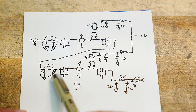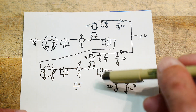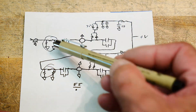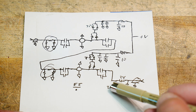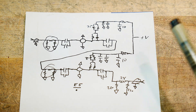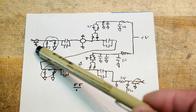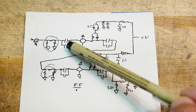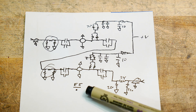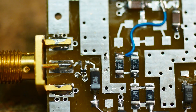It's interesting — he had a 75-ohm with a 75 in parallel, and then another 75 with a 75 in parallel, so four 75-ohm resistors adding up to 75 ohms total as the pull-up. Again, it went through a capacitor with another piggybacked on top, then on to stage 2. Stages 1 and 2 are exactly the same: same pad, same capacitors, same MMIC, same bias network, same piggyback arrangement. He was just playing with values — the pads on the input, and the capacitance wasn't sufficient.